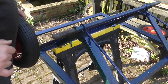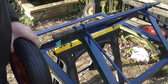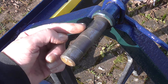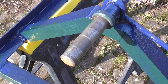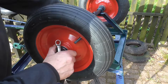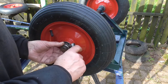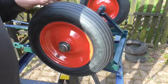I think what I'm going to do is get some spirits and clean some of this grease and grime off, just give it a little wire brushing to clean it up. I'd rather have them loose so they come on and off because they are quite tight at the moment. Now I've cleaned the muck off the shaft you can see the ridges - there's a distinct ridge where the bearing has worn the shaft away. Not unreasonable for 70 years of use. These front wheels are going on a lot easier - they're held on by a strong collar with a bolt through it, quite a well-made strong thing. Just tighten the bolts up on the shaft and that's the job done.